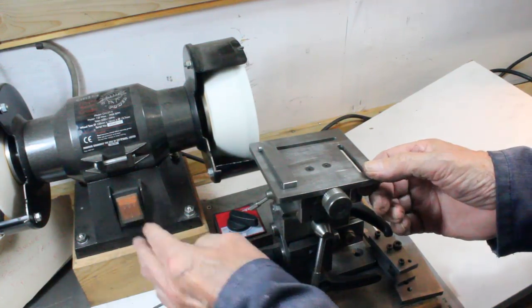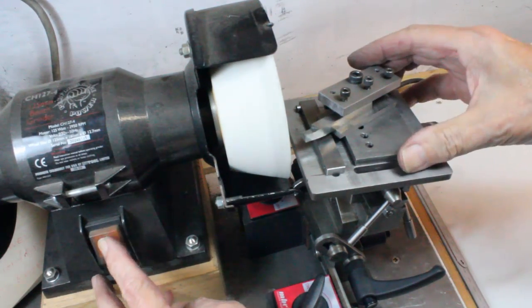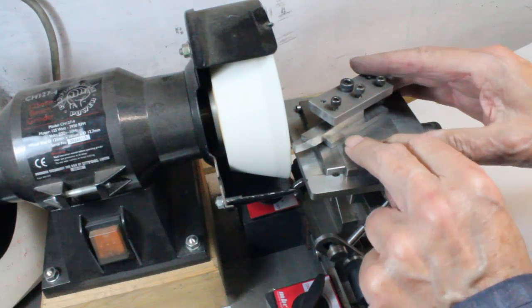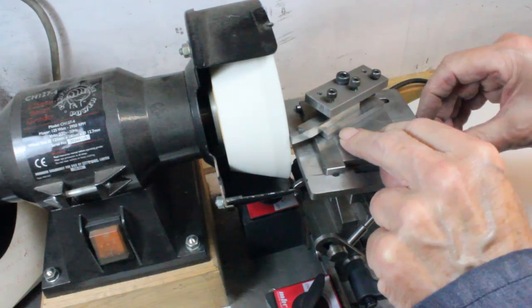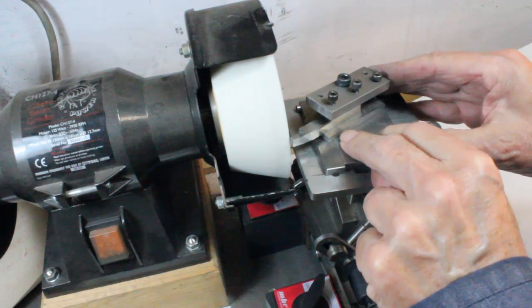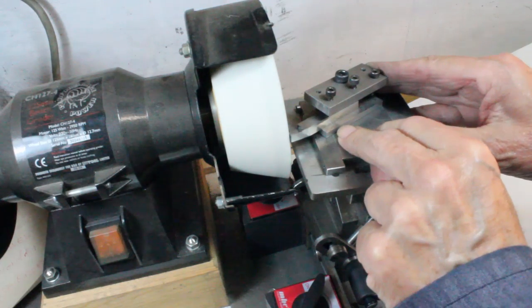The next stage is to grind the cutter's end face, being very little different from grinding the side face, with there being just 2 angles to be set up. The video does show though that the rest has been moved to the side and the cutter holder being set up across the swivel plate rather than along its length. Note also the position of the fence.